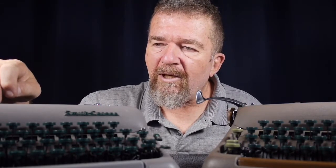The problem was that intermittently it would skip after the A, S, or 2 and quote mark. Why only those three keys? I think it has something to do with the fact that the linkages between the keys and the type bars are made in such a way that the positive action that activates the type bar is also working on the reverse side when the linkage pulls back — it doesn't freely pull back independently. So if anything in the whole machine is binding, it'll cause other problems. I did lubricate the hinge points for the linkages, and it could have been a little bit of hanging up on those three keys' linkages, causing timing issues in the escapement.